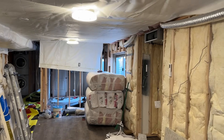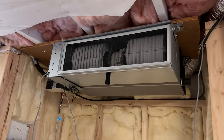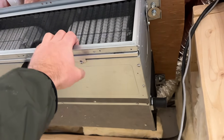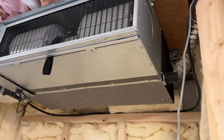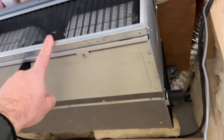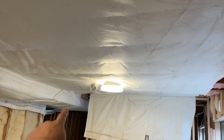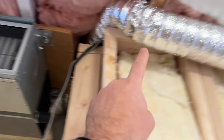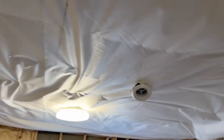This basement is unfinished but I wanted to show you this before sheetrock goes up. This is unit number one. We have the return here — a very easily removable screen that we can take out and clean and put back in just like any other mini split. The beauty of this concealed unit is you can move this return to here. There's the return on the bottom so you can actually mount this up onto the ceiling. This is the return air and then we have two ducts going for this unit and they're just a four inch duct.